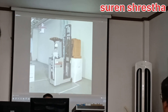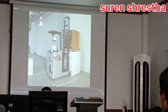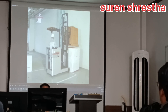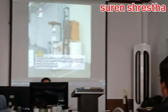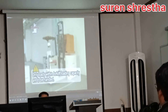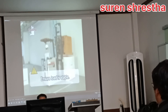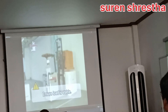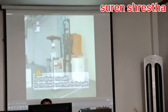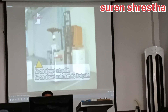Please be aware of the following to prevent any rollover accidents when loading. Only handle loads which are within the forklift loading capacity indicated on the load plate. Ensure the load is stable. Avoid unbalanced loads. Do not allow anyone onto the pallet or underneath the lifted pallet.